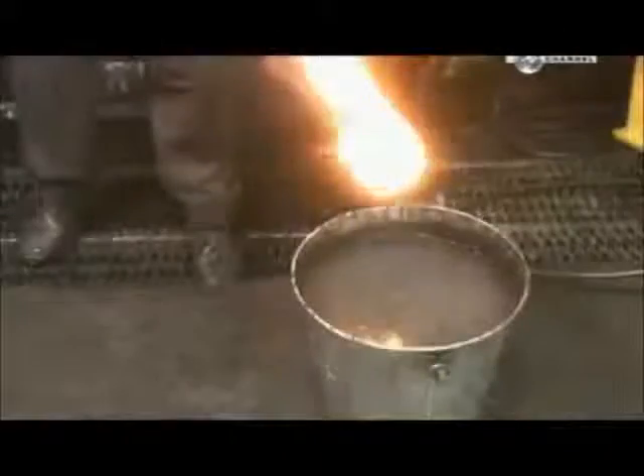About 1 in 10 forgings are dunked in water to check for defects. To make forging easier, they pre-lubricate the slugs before heating them — that's why the slug flames up when struck by the press. The punch applies 2,000 tonnes of pressure to form it into the initial shape of the piston. It only takes 2 seconds for the press to do its job, but the forgings are so hot they need at least an hour to cool before the next step.